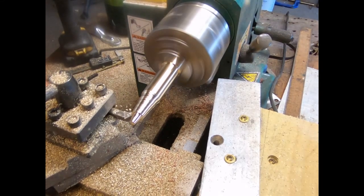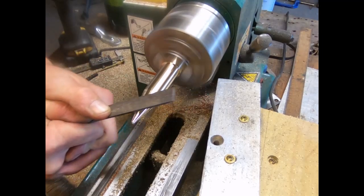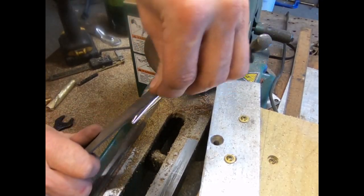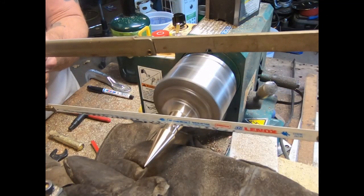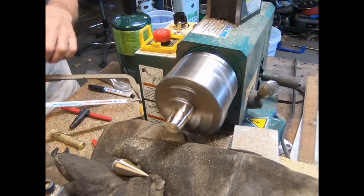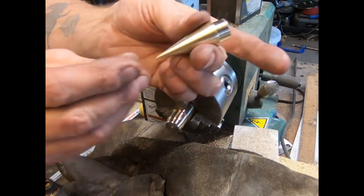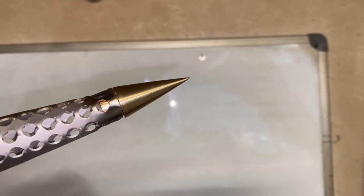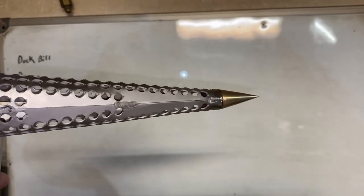It's got some power — look at the chunks of brass it can throw in your face. It does really well. It was about a $1,500 buy and I would definitely do it again. So the taper attachment was a little spongy, so I'm taking a file to it towards the end to kind of get the sponginess out of the blocks. Nonetheless, I ended up with a fairly highly accurate cone. I don't have a cutoff tool, so I'm just using a hacksaw to do this — and it seems to work out great. I'll probably never stop doing it. I did the same thing with the utility knife the other day. Man, that is a beautiful piece. Not too bad. So now we're going to make another one.